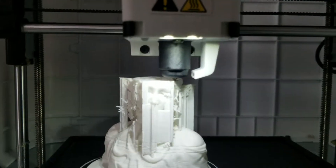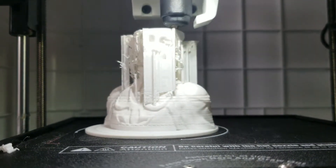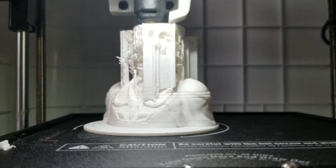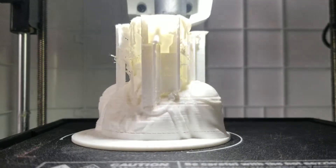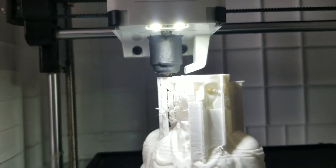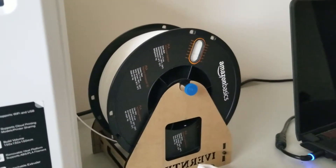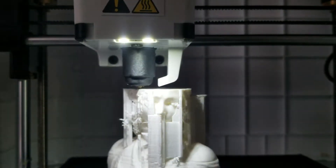It's turning out really well, actually, if you can see. At the bottom here you do see a few layer lines that weren't placed down properly. Thankfully the insides turned out okay. I've read that that has been seen with some plastics, so maybe it has to do with the Amazon Basics PLA, or maybe the fact that I left it out last night. I was mainly frustrated and wasn't treating it as well as I should have.